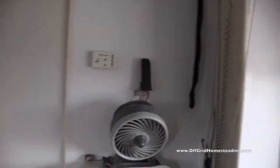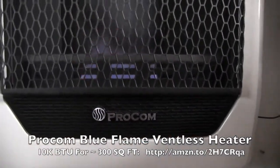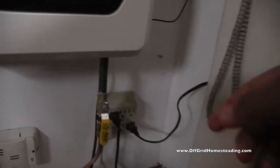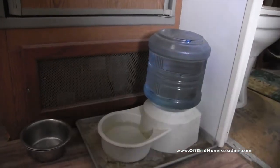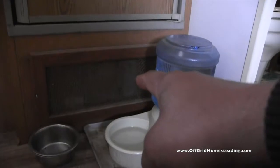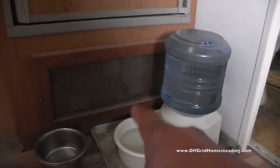Here's your blue flame heater — this is a 300 square foot unit, so I think it's approximately nine or ten thousand BTU. What I did is I had a copper line installed. We've got the old heating unit down here that was disconnected, and I took the line that was going into that heating unit. There are no floor vents anymore — we redid all the floors and took all the floor vents out — so we couldn't use the old heating system that uses a lot of electricity and a lot of propane. This one here does not — it's very efficient.